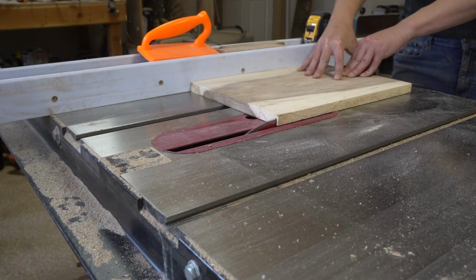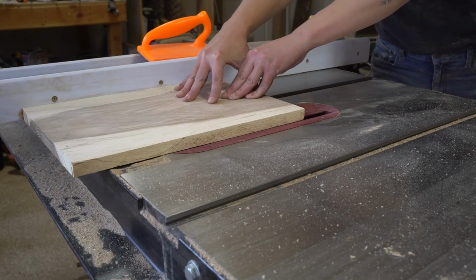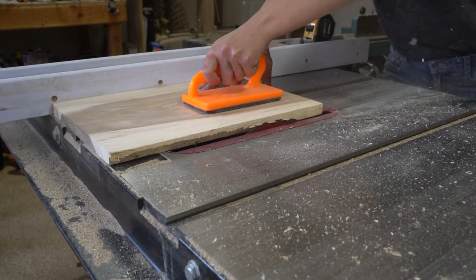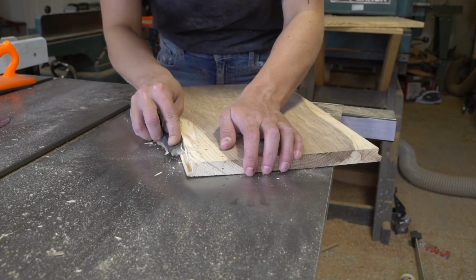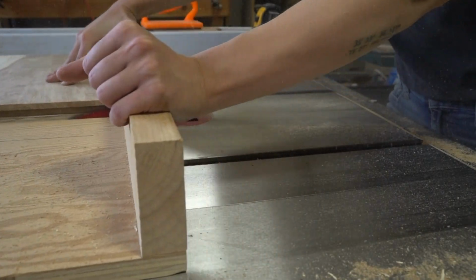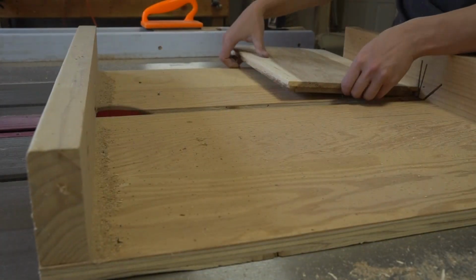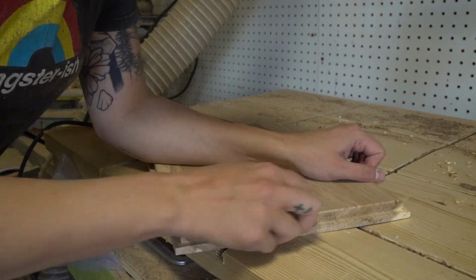With the panels in shape, I used the table saw set to a 1/4 inch below the surface to cut a tongue on every edge, then cleaned up the tongue with the chisel. Then, on the visible edge of the top panel, added a chamfer.